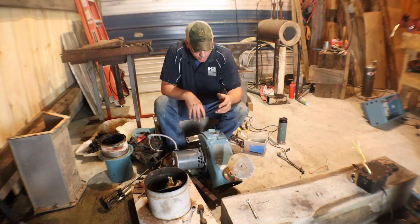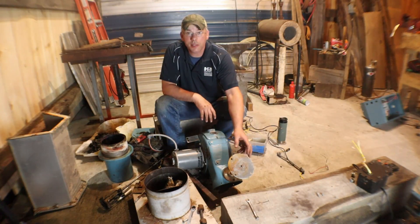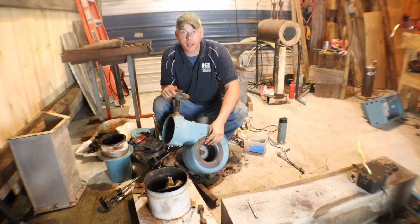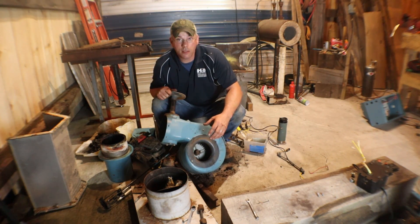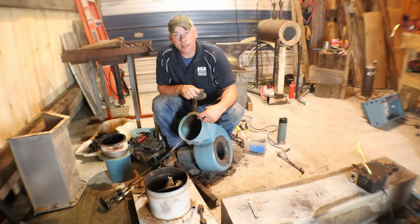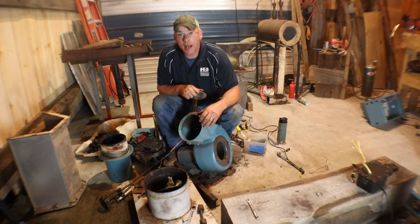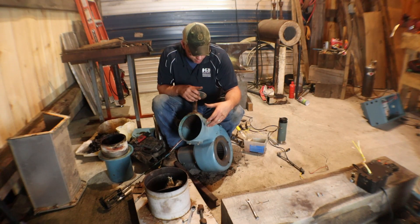That's a big thing for me - the ladders and all that stuff, getting on the extension ladders that high up, I'm just not comfortable with it right now. So how we're probably going to mount this - we're probably going to mount this right here to one of the floor joists, this plate. What I plan on doing: I will come off of this with a flange, like a 6-inch duct stove pipe adapter, run that into a small hood over top of the forge. Then this - I think this is probably going to be 8-inch - we'll tie into this piece and run it right outside. I want those exhaust gases to have a little bit of time to cool off before they even get to this point.